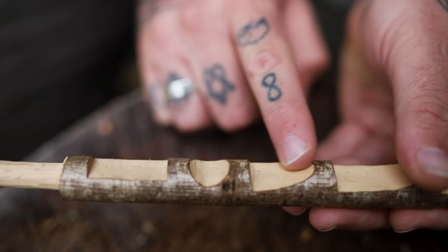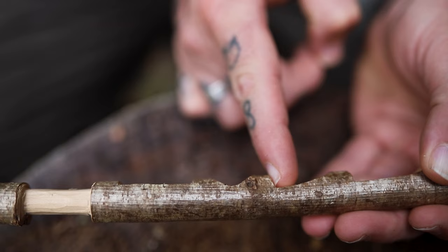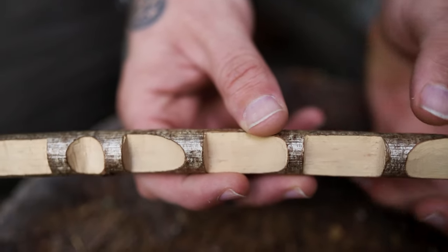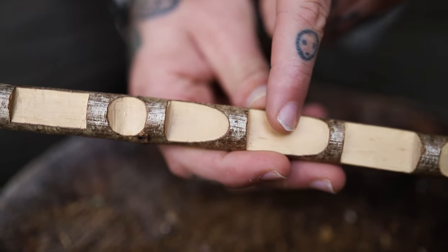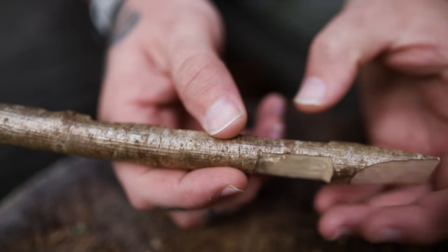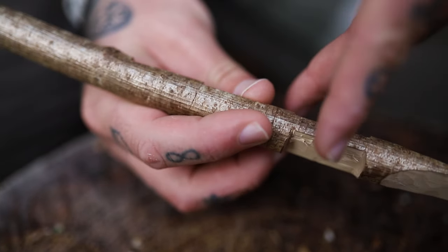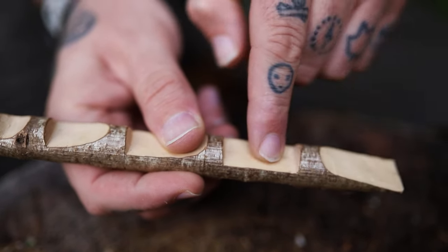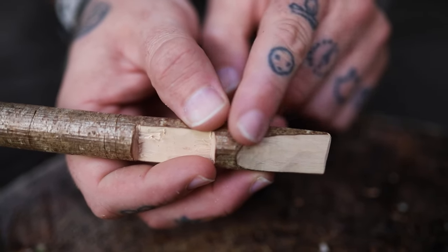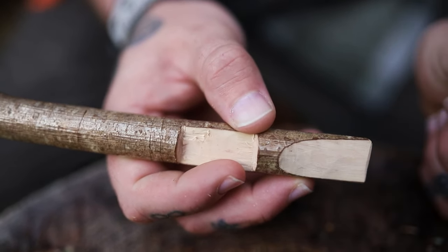This is a seven notch or a 90-degree latch, as some may say, most commonly used for traps — if you want something to sit like a seven, an L, or an L7. You can use this in trapping; it's also fantastic for tent pegs. Here is another version of a seven notch where it's extended on the belly, so if you needed things to sit together and wanted a bit more friction. Next to it is just a straight reduction — absolutely fantastic if you were using bow drills or wanted to thin out material for a similar joint. Creating a hole in the middle of this notch is fantastic for bow drill bows so you can attach cordage. And last but not least, we have a pointed wedge, which can be turned with a very simple extra cut on the bottom into a root stripper — what I use for tent stakes most of the time.